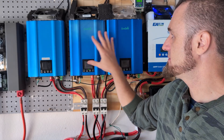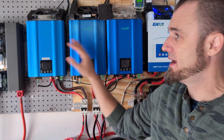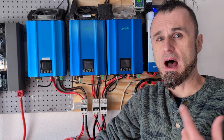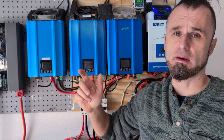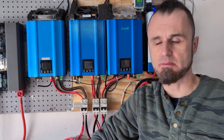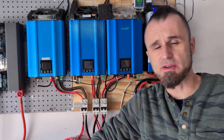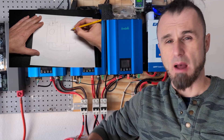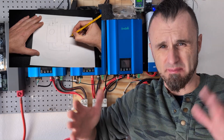When you have a high surge, these will push 1,400 watts. In my case, I have two on line one and one on line two. For those wondering how you distribute the power between them — each line in the panel in a split-phase system has separate consumption. It's very interesting, but the meter doesn't care about that. I'll explain it on a piece of paper.